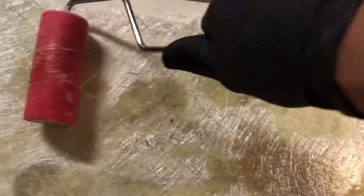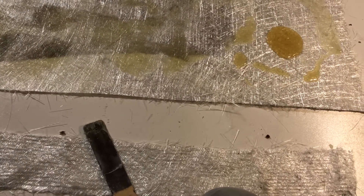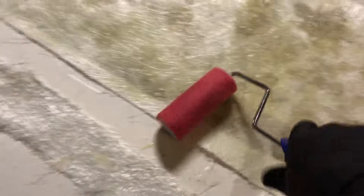See those dark spots — that's kind of what you want. Spread it out nice. I hear in a lot of videos: don't overdo the resin. You can see right there how it's wanting to pull the mat up, so you're trying to get it without pulling too much fiber off. I'm definitely going to have to mix some more. I'll film the piece when I'm done and add it into the video so you can see how I wet it out. You can see the dry edges where I don't have enough, so I'm going to mix up the same amount again. Thanks for watching.